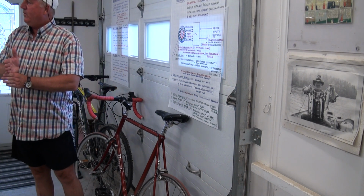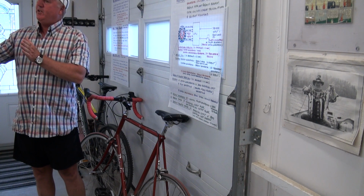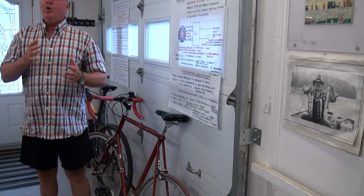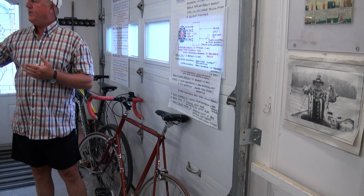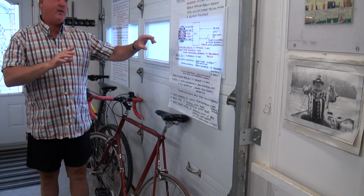At the same speed, 0.1 ohms dictates regenerative acceleration or regenerative braking. And also the frequency of operation of the 0.3 ohm coil. You can get a 0.3 ohm coil to go into regenerative acceleration if you increase the frequency. So there are different parameters. Now, the frequency is dependent on the speed of the motor? Speed, yeah. The frequency of operation is dictated by the number of poles on the rotor and the speed of operation. So let me finish this.